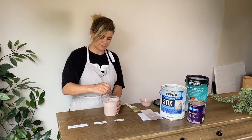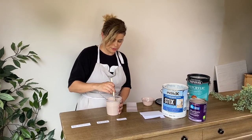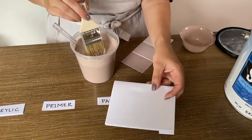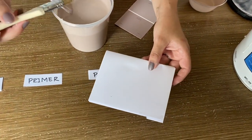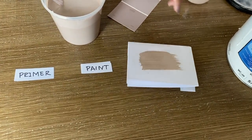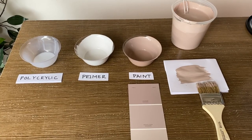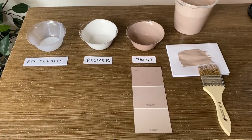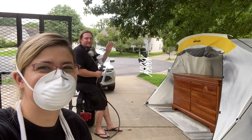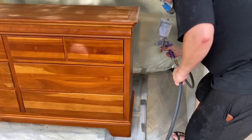As far as which brand of paint, primer, and polycrylic or water-based polyurethane you go with, just make sure all of your products are water-based. Also, depending on your project — I use Zinsser primer if my project has more of a slick surface. I'll use a bleed-through blocking primer like Kilz — water-based — if I'm doing something that might have bleed-through, and I keep some sand and seal or spray shellac on hand if I get bleed-through.